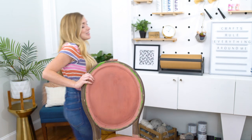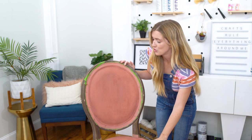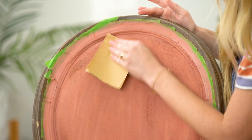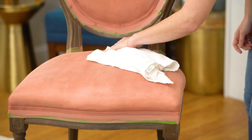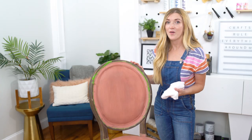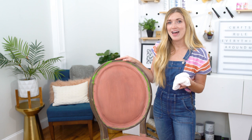Just bringing this back in after the third coat. It's looking pretty good. I think I'm going to do one more light sand, and then I think that might be it. After our final sand, I'm going to take this wet rag and wipe off some of the loose dust. Now I'm coming back with a dry rag — I've gotten most of the dust off. I'm going to let it cure for 24 hours, and after that I don't expect to have a problem with transfer.